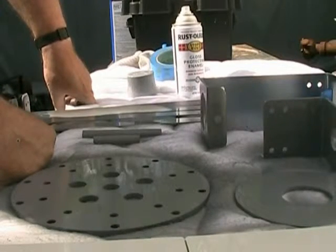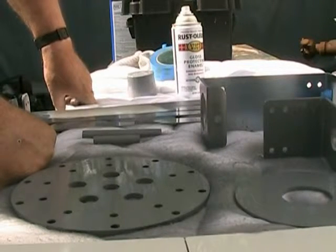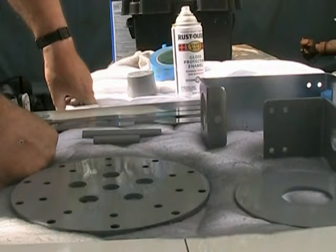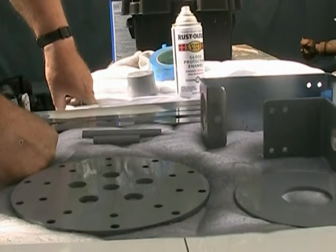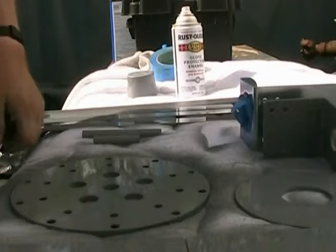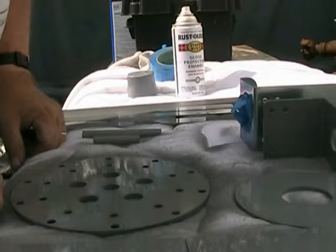The next thing we'll talk about is painting the PMA itself, and we're going to talk about wiring, connecting your wires with the solder method, which is the best method, and some shrink wrap, the size of the wire you should be using. We're going to talk about a whole bunch of things on the assembly of this, but for right now, the reason you're painting this, and I'll remind you, is so that when you put those two pieces together, they won't rust behind it because the moisture won't get back there and cause the metal to rust.